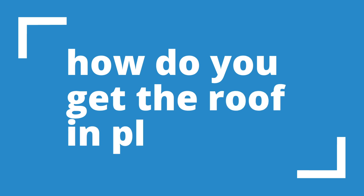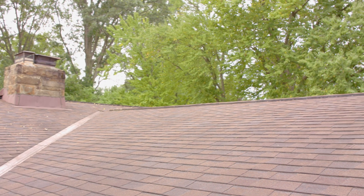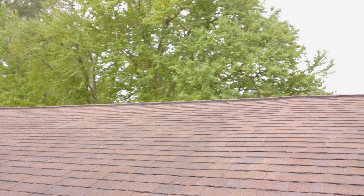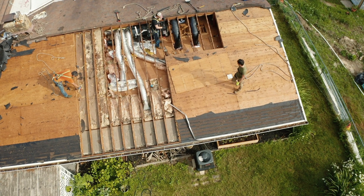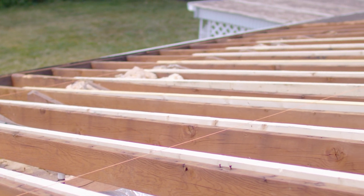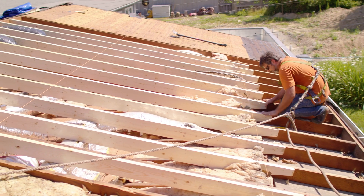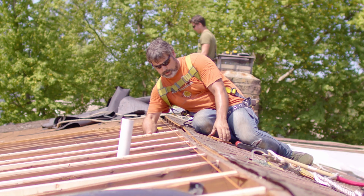When it comes to making sure you've got a good in-plane roof, the first thing to do is visually inspect it. You can walk around the house, look at the ridges, look up the roof line - your eyeball is going to tell you a lot. On Adam's house there were really large dips in the roof, so we tore off a section of plywood, ran string lines across the roof at the plywood height, measured down, and sistered two-by lumber on there to flatten the roof. In that area we also had plywood rot, so we had to take the sheets off anyway.